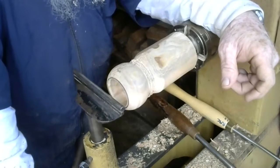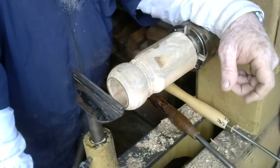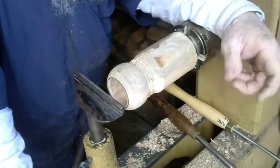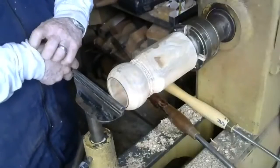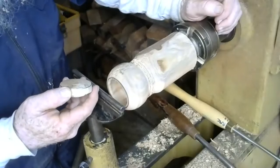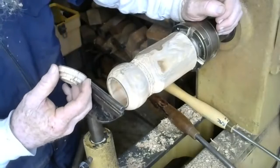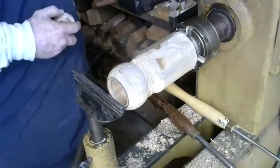Right there where you say you're going to put a taper on the inside, he made that straight. He didn't put a taper there. So he just cut it like a box lid. Right, and the same with the plug. Well, that would work too. The reason for that is he wanted as much glue surface on the piece as he can get, because you're going to hold that plug on the chuck when you finish the rest of the piece. So he didn't want it coming off. That's just another way to do it. Okay, that works.